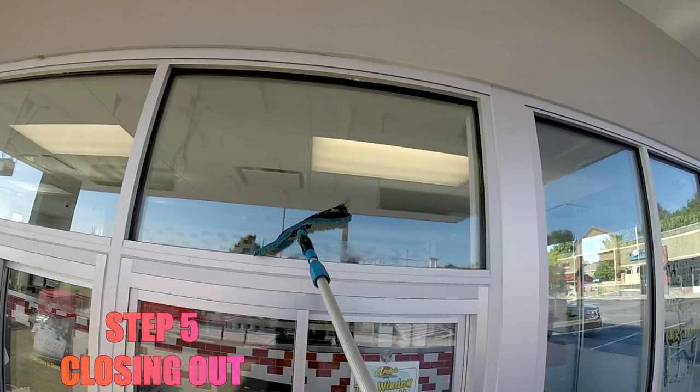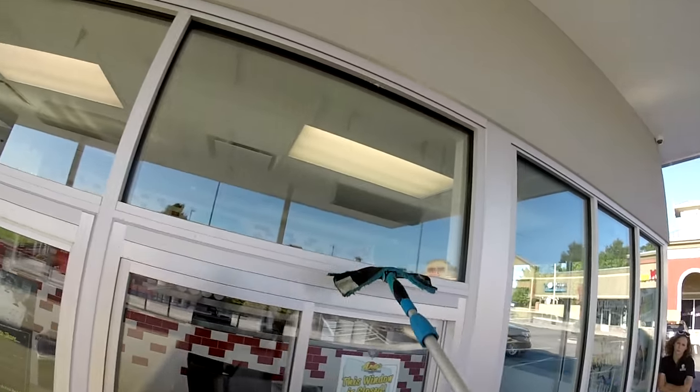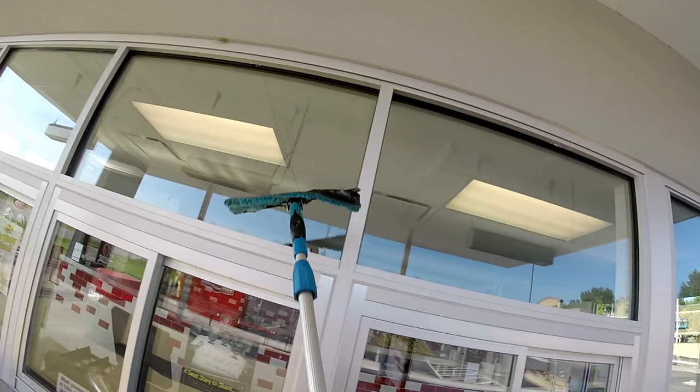Step 5: Closing out. You will find closeouts with a pivoting tool on a pole allows a lot of flexibility and freedom. You can close out on different spots on the window depending on the obstacles and situation. On standard windows like this, I typically close out in the center or near the right of the window. To flip your mop back over the squeegee, simply give it the same upwards motion push as before.